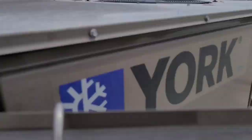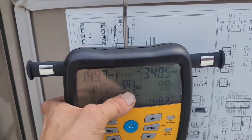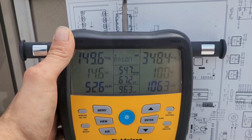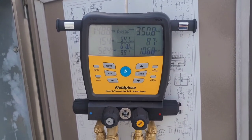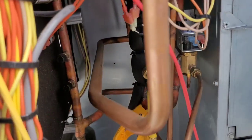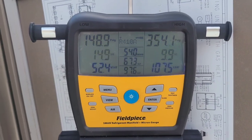I've got it back on now and it's been running for a little while. It's running a good 9–10 degree sub-cool, doing pretty good. This is the temperature going into our blower that's being pulled across our evaporator — so that's our supply air temperature. It's in dehumidification mode, which uses these controls here and does something through this piping I'm not sure about. Right now we're running 8–9 degree sub-cool, and it seems to be working pretty good. I'm not sure why it would have tripped the high pressure event. This thing down here seems to be operating correctly, maintaining the head pressure around 350–353.